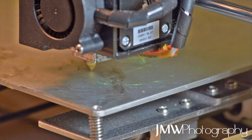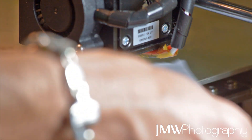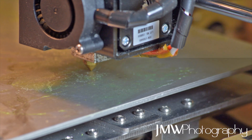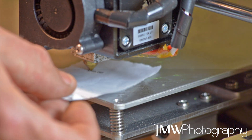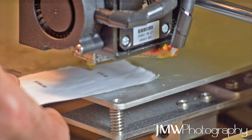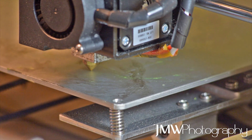Now we're back at the beginning. My bed was pretty well leveled when I started this video so I only really needed to go through once. It could be a little bit more of a fine adjustment. Once you're confident that it's feeling good and looking good on each and every corner - every corner feels the same - there's a bit of tension. It's almost like it's holding it but it can still freely move in and out if you just gently slide it. The tension is purely that piece of paper - that's the distance. It's not pressing down on it, it's just that distance there.